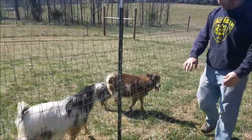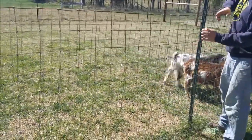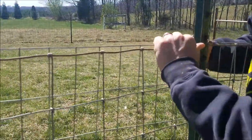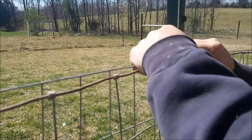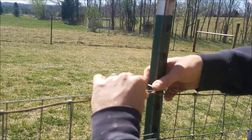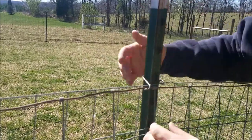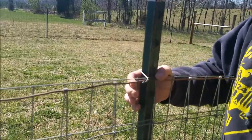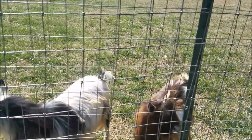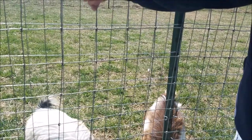Now that we've got that stretched out, we really just need to repair this section for right now. We're going to pull this as tight as we can — we already have some t-post ties here — and hook this up so it will hold in place temporarily until I can bring more t-post ties out here and clip it back in place. Then we'll go strategically throughout this section and, using high tensile wire, weave it in and out of the woven wire and the welded wire, stitching it in place almost like quilting.